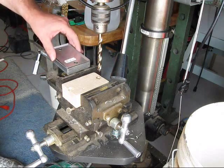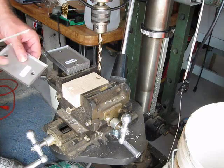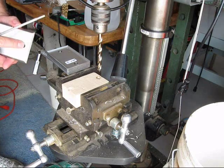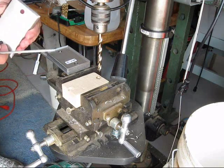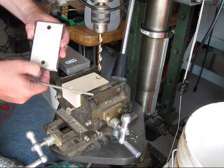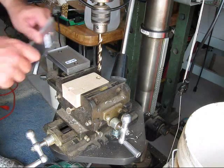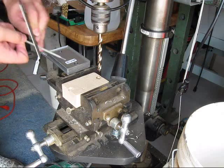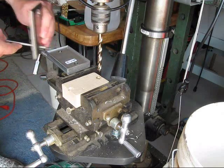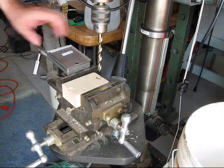But there's one more thing to do — I need to take a round finishing file and knock off all these burrs on the backside of these plates. There might be some on the front side too, but they're usually on the backside. So I just take the file and file all that off. Believe it or not, the finish work takes longer than the rough work. When I'm done, I should have a bunch of plates that I can start using.